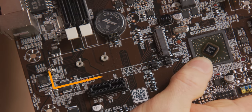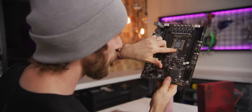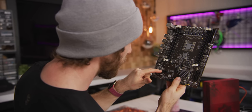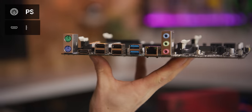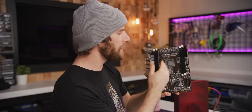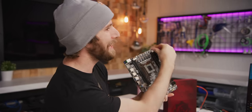It's also got an M.2, so it has modern features but also super out-of-date features. There's almost no PCI Express connectivity — whatever's linking it to the chipset, four lanes for M.2 presumably, and then another one lane for this. I'd assume that the USB and Ethernet are handled directly off the SoC or off this chipset: just four USB 2s, two USB 3s, and gigabit LAN. The memory slots are on either side of the CPU, probably because this SoC was designed with RAM soldered to the board around it, so the traces have to run on either side.